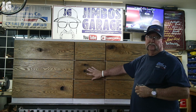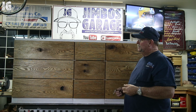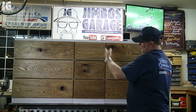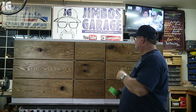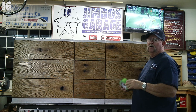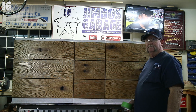I'm a little concerned because everything is already stained and complete on the drawer fronts — I don't want to take a pencil and mark up the centers for drilling. I thought a good approach would be to put some painter's tape all the way across all three sides and down the center, then find the centers and mark on top of the tape. When we drill the holes, the tape should lessen the chances of damaging the drawer fronts, and it won't harm or discolor the surface.